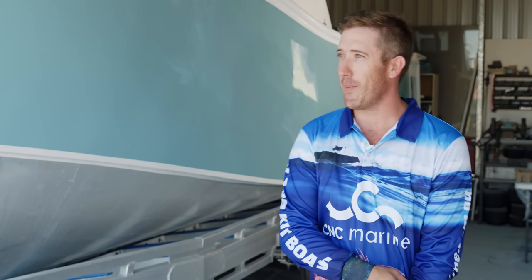Windows have been a nightmare. Everyone's so busy in the industry trying to get quotes, and that's pretty much what's stopped me from getting on the water — just the windows. One of the hard things being out here is there's not a lot of big industries with the machines you need for the bending. You need a pretty big press brake to bend the sheet, especially with the one-inch die. People have got them around here, but only small machines — not the big dies. That was a little bit difficult trying to organise.